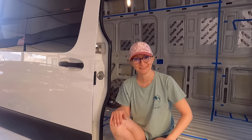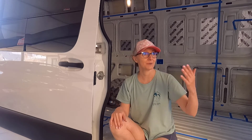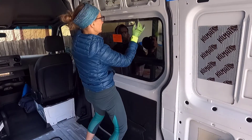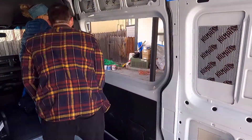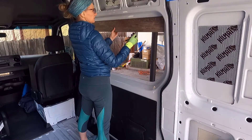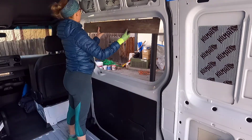Secondly, move next to some awesome neighbors who come and help. These window installations require at least two hands. His partner helped at one stage, so I had two people pushing in as hard as I was pushing out while I was drilling the frame. In the last phase when you go around the inside and screw it in, you need people pushing hard in the other direction, because the last thing you want is your brand new window to go back on the ground.